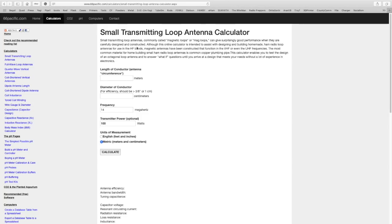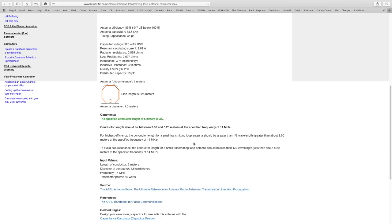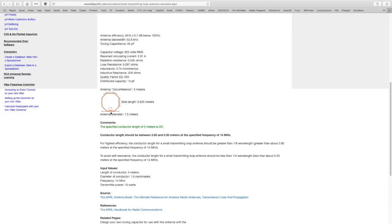I'll put the link down here in the description. I remove about 15% from the perimeter length of the loop. Here's the 66pacific.com website that I use now for calculating magnetic loop antennas. For the circumference, which is the perimeter, I'll put 5 meters, about 17 feet, and the diameter of the conductor is about 1.6 centimeters. We'll stay on 14 megahertz, 20 meters, and I'll probably use no more than 10 watts. Let's see what we get. Scroll down, and you can see the design of the antenna here. It's an octagon, which will be made, of course, with copper tubing, and it's about 1.5 meters tall.